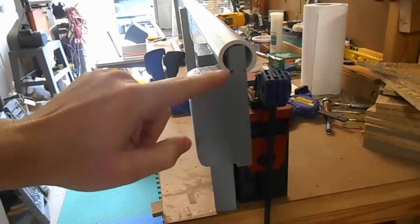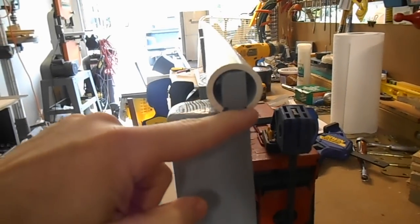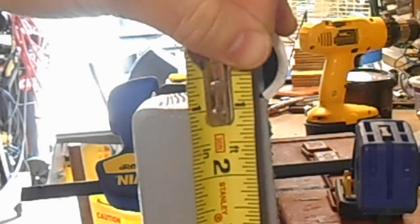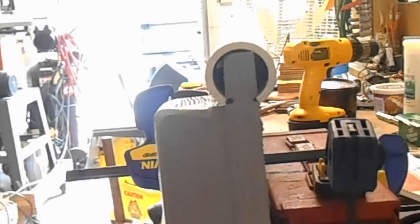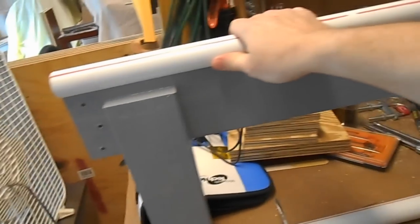That's why you want to cut the groove undersized a bit. You can see how the corner kind of grabs into the slot a little bit — that's what you're shooting for, you want those two edges to sort of bite down in there. Seven-eighths of an inch. So as long as you follow those measurements this will work out just fine. The real trick, like I tried to show you earlier, is getting that gap milled straight, and that's where having a table saw — you really almost have to have a table saw in order to do that. Instead of 25 minutes and my arms being sore, that was about four or five minutes gently tapping and getting it in there. So let me swap this out and go ahead and do the third rail and then I can put this together.